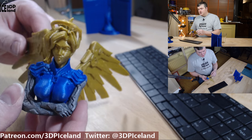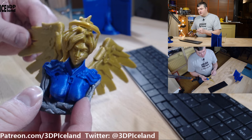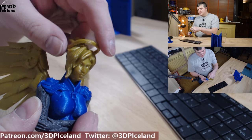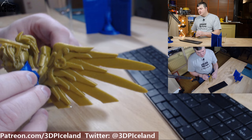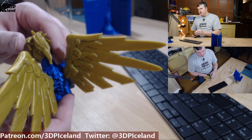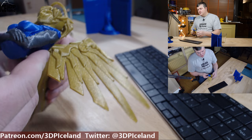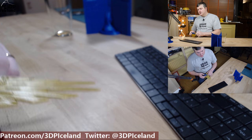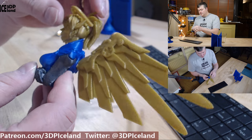There were a lot of supports I had to remove for those prints because of a lot of overhangs — things hanging in there like this piece here — and the wings also needed supports because they are floating. I wanted to print them upstanding so the bottom or back face would have good detail as well as the front. I didn't want to print it lying down on the bed, which meant a lot of supports, but it came out great after I removed the supports.